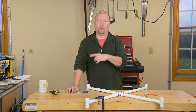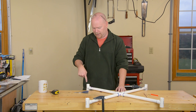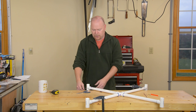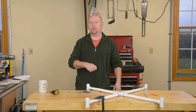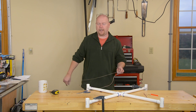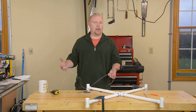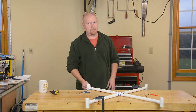I wish I had some good advice for you for winding the wire around these loops, but I don't. It's a tedious process. The only way around that is to build a frame that instead of being drilled through on the ends just has slots, so you can literally just wind it around — that actually is far easier. But if you're going to do it this way, I would suggest that you find the center of your wire and put it through the middle hole on a leg, and start in the middle so that you don't have to pull all of the wire through every hole — you only have to pull half of it through every hole. Also, calculate the length of wire you're going to need and don't use a whole lot more than that. Theoretically, I need 88 feet of wire for this loop — I have 100 feet. If you get a 250-foot spool of magnet wire or something like that, don't unwind the whole thing.